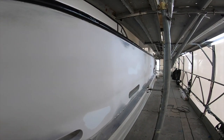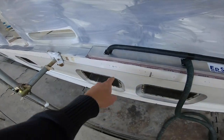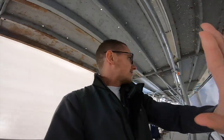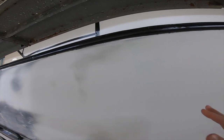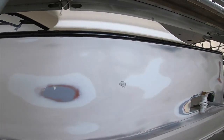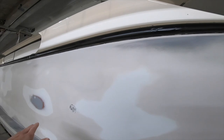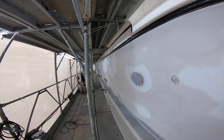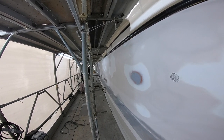They paint the spy on the entire surface of the hull structure. Then they get a thing called a longboard — you can see this piece of material here with sandpaper along it. They work in twos sanding the entire area. The reason they use the spy is to make sure there are no craters or divots, so the whole surface comes out absolutely straight. They sand down until all the spy has gone and then they know the surface is straight with no craters or unevenness.